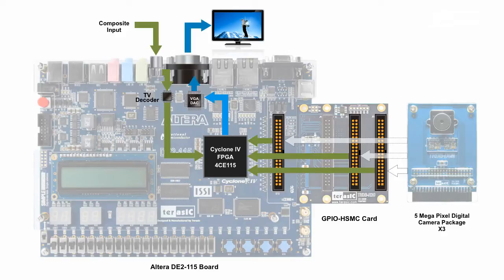The most important part of this design lies in the SDRAM controller. Four independent feeds means they all have four different timings. That requires a four-port read and write operation.